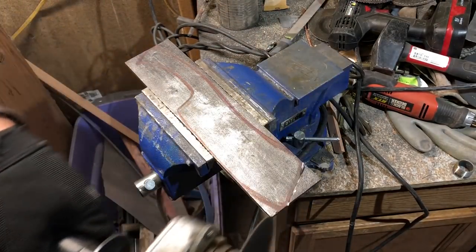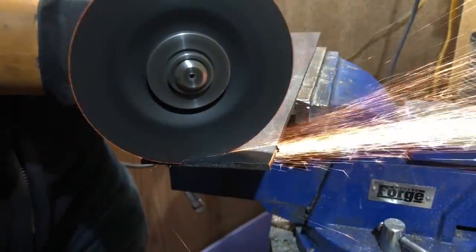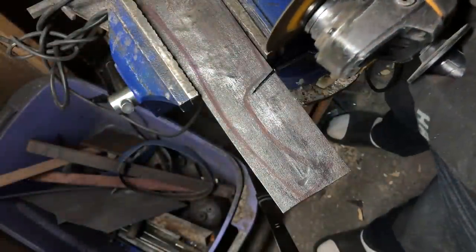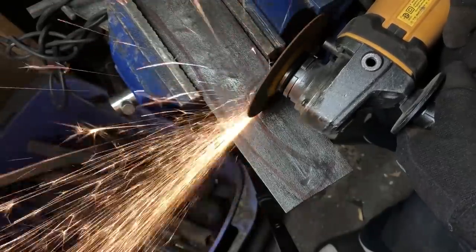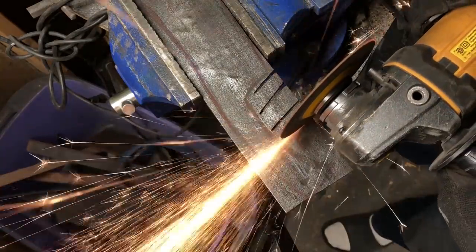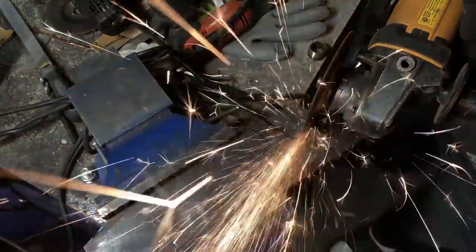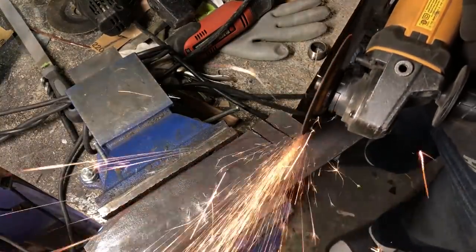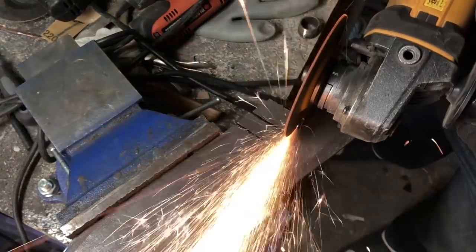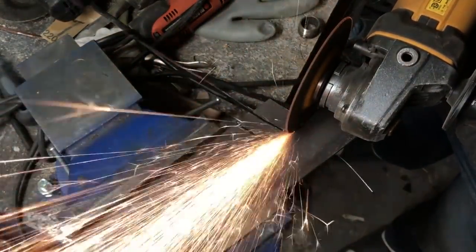Now there really isn't a whole lot to say about this next part of the process. It's very similar to when you're making the long straight cuts. You want to go a little bit slowly with it — don't apply too much pressure because if it binds, the grinder can really jump. I will admit I've nicked myself a few times with one of these and it's not fun. Depending on the shape of the knife that you're going for, you may find yourself having to cut into some smaller contours, more confined spaces. One of the drawbacks of the grinder is that you really can't get into a tight space and make a turn. You can improve your maneuverability a little bit by breaking up the task into smaller pieces and cutting those out and getting those out of the way. Again when you're making cuts like this, always be aware that if the cutting disc catches suddenly — because it's moving at very high speed — there's a lot of energy in there and that grinder is going to really jump on you, so make sure you have a good firm grip. Always wear protective gear and avoid loose clothing or anything that could easily catch in the grinder.